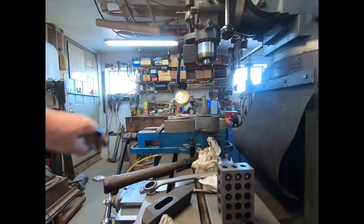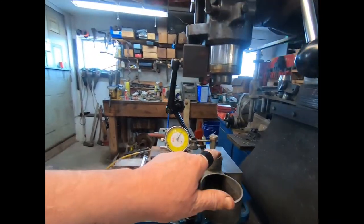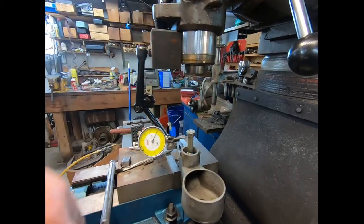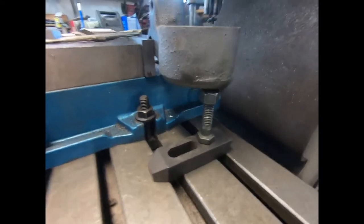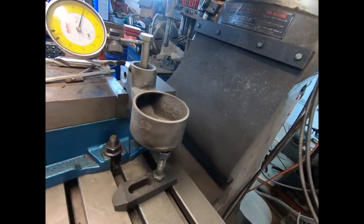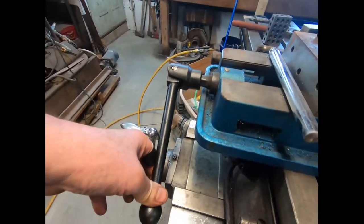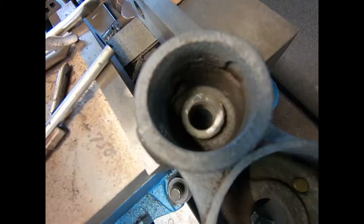Boy, that's deceiving. It looks like it's way off. But the bolt is straight. This surface here is way off. So I'm going to kiss this and make everything parallel to the threads while I have this thing balanced here. I don't have a machinist jack, but the bolt's good for a couple hundred thousandths of travel. So I've got that just finger tight, just to keep that from drooping when I start milling. I got this as tight as I dare to put it. So I'm going to put an end mill on. I'll see what we can do.